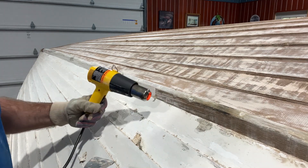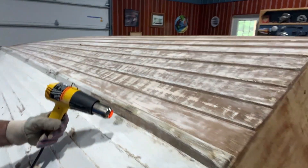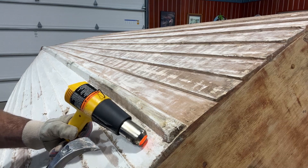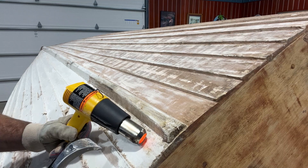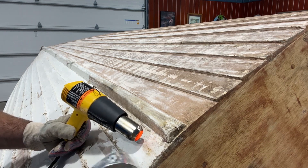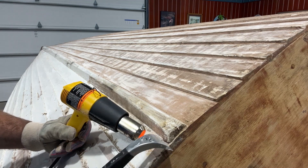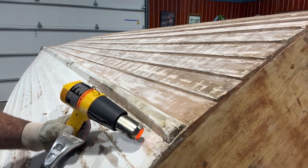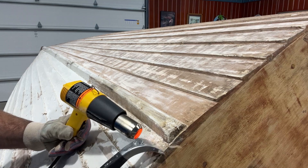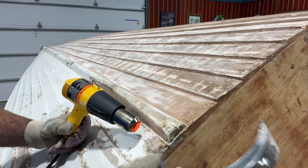These planks have different bevels on every one — convex to concave — and I heat them the same way. It takes about 15 seconds instead of 15 minutes like the stripper does. Sometimes you see water boiling and bubbling up, so you know there's a little bit of dampness in this. The beauty of this Wagner heat gun is it also has a fan, so it's blowing the debris away from your work. I go up and down because of the bevel issues — look how it just peels that paint right off. That's old 5200 popping out.